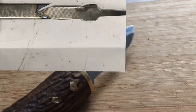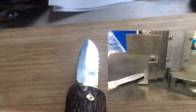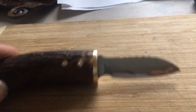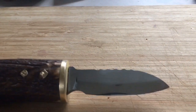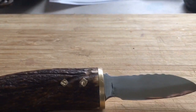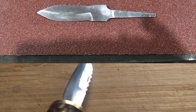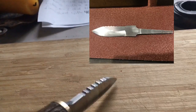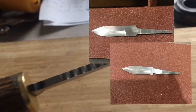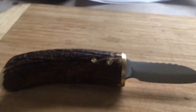I normalized the file, I put the shape on with a paper template, and I started working on it with a file. I did no grind job with power tools or anything. I had to sand it a lot and made sure it's square and nice the way I wanted. I think it turned out great — it's well sharp.